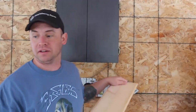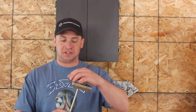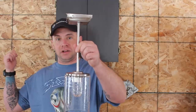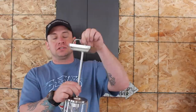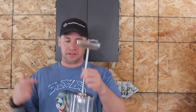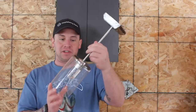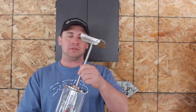We don't want to go put something on there and a couple of years down the road regret it. So we're going to throw those up. We also got this light, which we're probably not going to put up today — it's going to hang in the kitchen. It's a DC light with two wires I already have in there. I'll hook up a switch near the front door and run a fuse right before the battery. It's a 12 volt DC light — that's going to be awesome. Probably tomorrow we'll put that up after I pick up some wire in town.